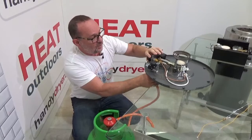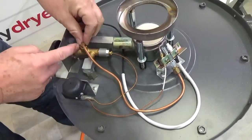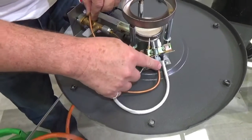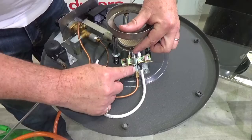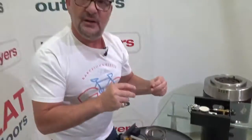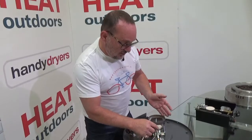Assuming the hose is clear, we then come up to this next section — something's got to be wrong between here and here. This is a very simple tube with a little valve inside that opens when you turn the knob. It's very unlikely anything's going wrong in there, and it's also unlikely this tube is blocked, but you can take it off at both ends and blow through to make sure. In this little section here is a tiny valve — another piece of brass. When you unscrew it, it comes out and in the middle is a minute hole, and that's the hole the gas is pushed through to give you your pilot light. Sometimes that hole gets blocked — this can be caused by insects going in over winter, which is a very common problem. Anything tiny, any little bit of detritus blown in there, can block the hole, and with that hole blocked the whole unit won't light.